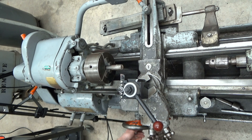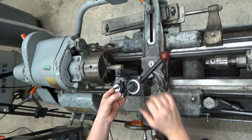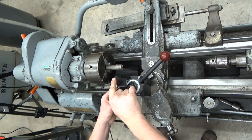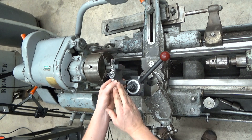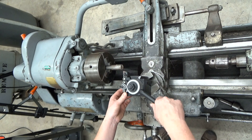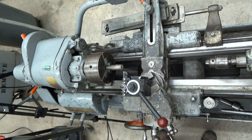When we do this we have a cutting tool that looks like so. This one has about an 80 degree angle to it, so it's good for operations that are facing as well as turning. Generally with any lathe work you're cutting with a single point and we're not cutting with the flat.